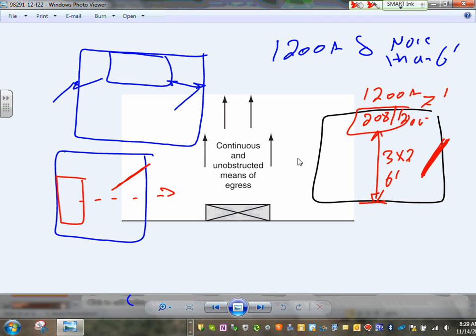One more time, guys. There's working space required around electrical equipment. Typically the width, 30 inches or the width of the equipment, the height 6.5 feet or the height of the equipment, the depth from 3 feet to 4 feet, depending on the condition. If your equipment is big, fat, fluffy equipment, like 1200 amp or higher,